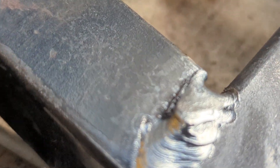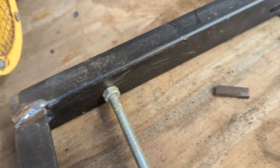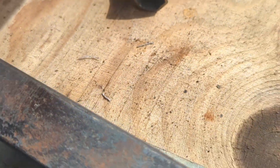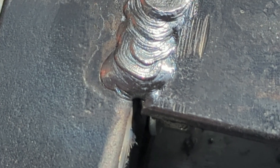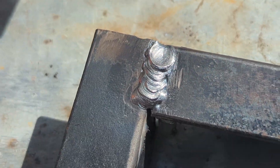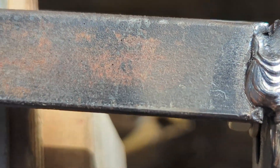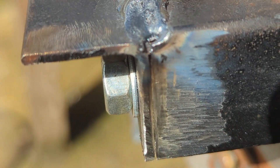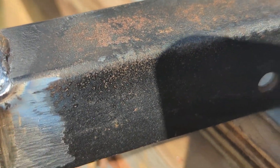So that's just a quick clean up. Still got a bit of slag there. That one's pretty good. That one's pretty nice, stacked a bit high but it does look beautiful in the zoom. And again that one's stacked a bit high. We've got the penetration.